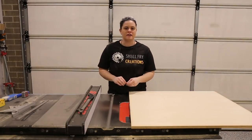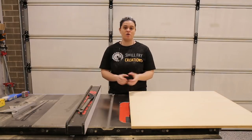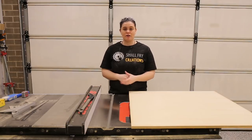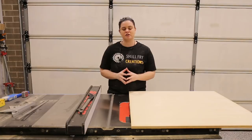I've got all of my triangles in glue-up and while they are drying let's work on the top section, which is really just a rectangle with some slots cut in for wine glasses. It's 250mm deep by 350mm wide. I'm going to cut that on the table saw and then I can head over to the workbench and get everything marked up to cut the slots for the wine glasses.